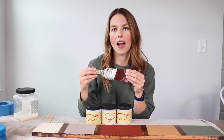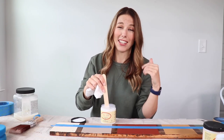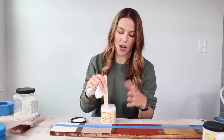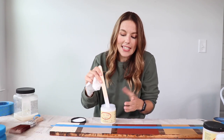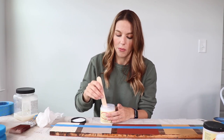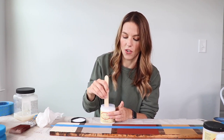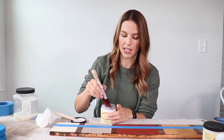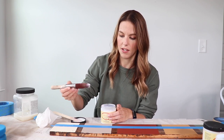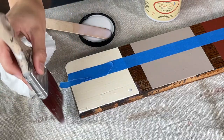I'm going to put all these on with a dry brush. I like to use the mini or the angled mini to put these clear coats on. The first one I'm going to do is flat — flat is my favorite. I love using this on raw wood that I've stained or done a chalk wash on because it just looks so natural, like raw wood. When working with clear coats, you want to mix them up really well because all this stuff can settle at the bottom — they need to be stirred really well. I'm using my synthetic angled mini to apply this, just getting a little bit on the brush. These are all self-leveling, which is really great. This is going to dry down to a flat finish with no yellowing, and you can build up to three coats for the protection you want.